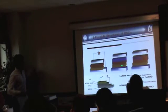Now they came out with this: our glass slide, ITO, P-type, N-type, and then the metal contact. These are the heterostructures or bulk heterojunctions, and they turned out to be good, efficient ones. Glass slide, the ITO, indium tin oxide, and then the blend, the mixture of P-type and N-type, and the metal contacts. So they are trying to increase the efficiency.